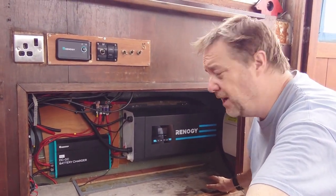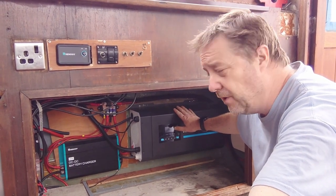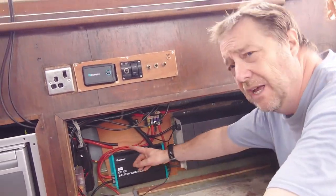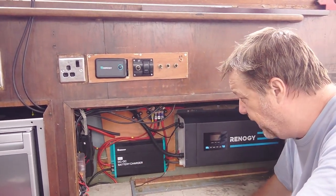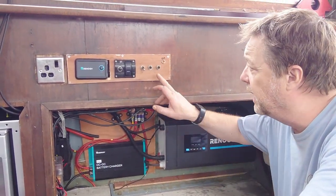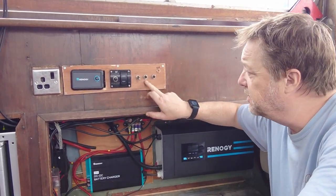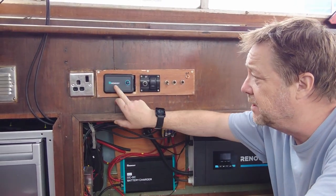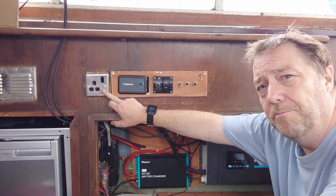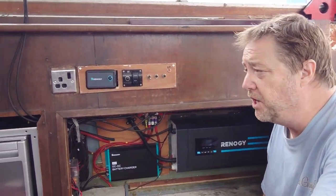This head-end cupboard is almost completed. Batteries are installed, we've got the inverter charger, a DC battery-to-battery charger for the engine alternator — although we haven't got an engine at the moment — and the solar charger, fuse boards, and wiring. We've also got one of the sub boards including the Wi-Fi, the bilge pump, the secondary bilge pump, and the water pump, as well as the controller for the inverter. And then we've got actual mains as well, either from the inverter or from shore power.